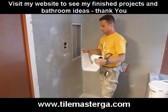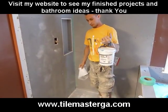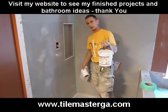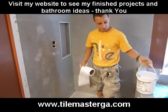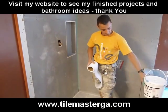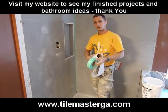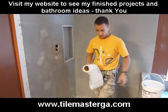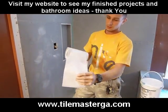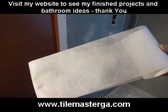Only this one, combined with a waterproofing membrane, will work pretty much like a shower pan liner. After it dries, it will turn into a very similar product. The other type of tape has holes that are too big — it's not going to work as well as using this type of fiberglass tape. This is the way to go.